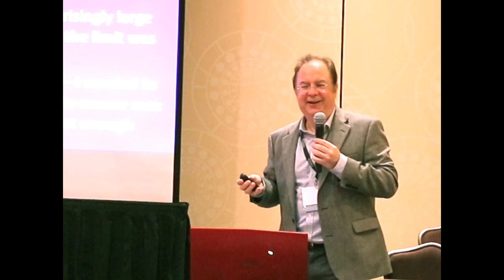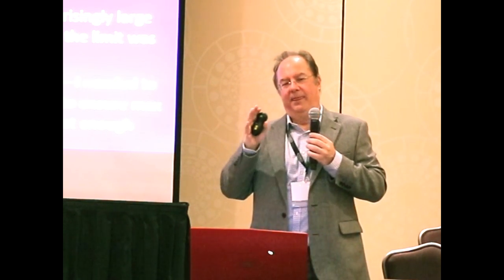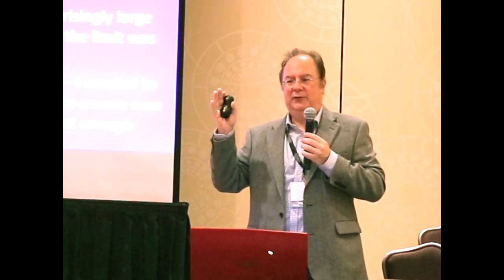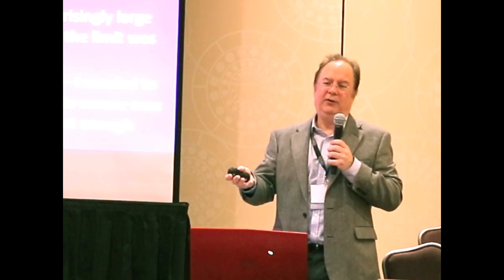In the 1980s, a million taps. We didn't even have FIR filters, it was just inductors and capacitors. This was impossible. This was always going to be impossible. So the million taps was actually quite a big thing for me personally, because it's a lifetime's goal to hit the million taps. What I found was, when I did the FPGA, because I heard with Dave not a huge change going from 26,000 taps to 164,000 taps, because it took me 9 months to design three different filters and then eventually get placement, routing and coding to work, I didn't want that headache.